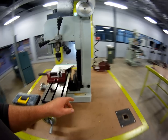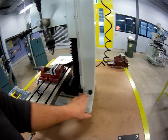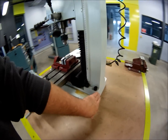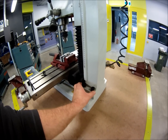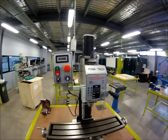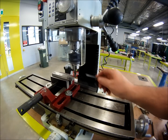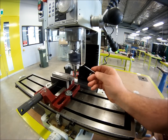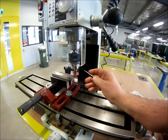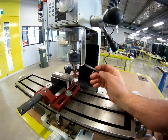He's also produced a little manual that comes with it. Another thing I love about these milling machines — notice how they bolt vertically on the column. They mount on the horizontal plane, unlike the Grizzly type which mount on the back with four screws. This is more traditional, like a real milling machine should mount. I'll put the R8 in now. I've got the drill chuck in at the moment — please, I don't recommend anybody do any milling in the drill chuck. Always use a collet to hold your end mill.